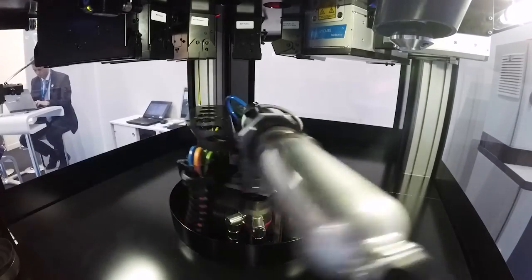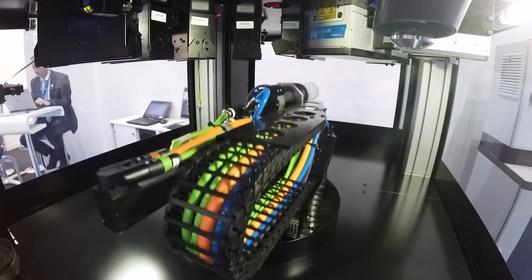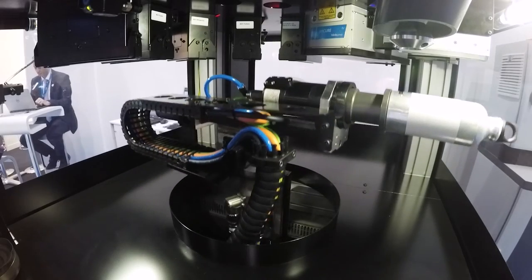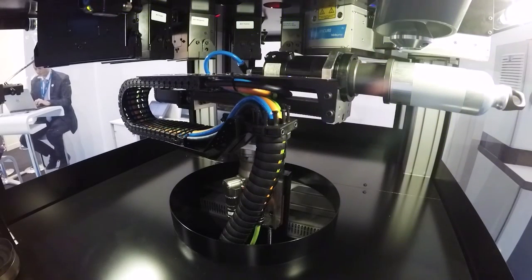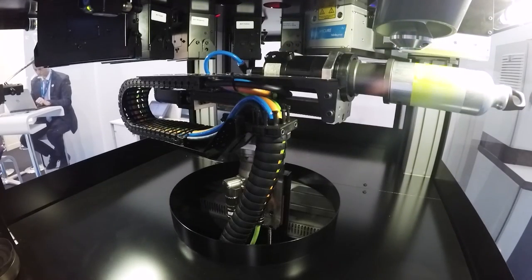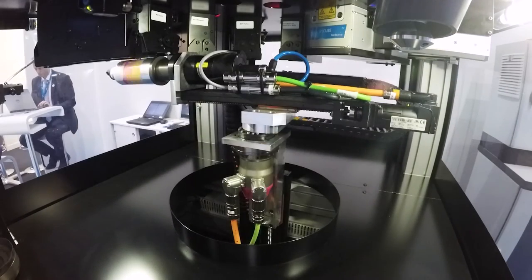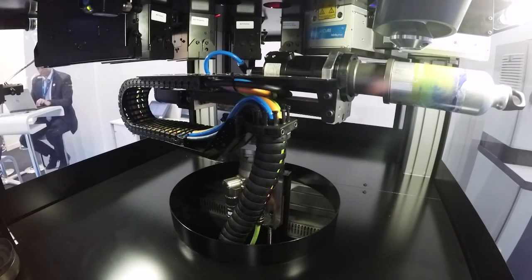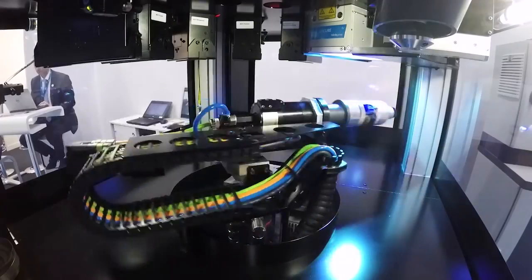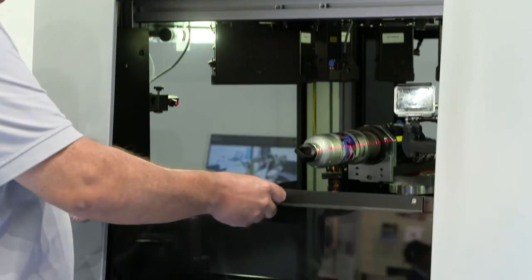The Omnifier 250 is a UV inkjet system printing CMYK — four colors — plus opaque white. For silver or colored bottles, opaque white is printed underneath. Colors are applied one after the other, each with intermediate drying, followed by final UV drying. The process takes about one to three minutes per object, after which it is dry and can be taken away immediately.